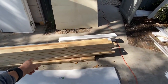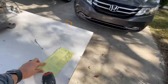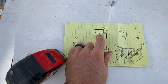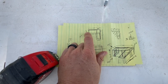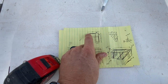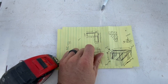We're going to use these 2x4s to frame out. I'll show you the drawing here — this is my scratch, I wouldn't call it a drawing. We ordered pillows that are going to be on top. They're 45 inches long, 18 inches wide. And for the back corner, they only had a square pillow that was 20 inches, so we're going to have to make everything 20 inches. We're going to put a little back brace to fill in the 2-inch gap so our 18-inch cushions fit in good.